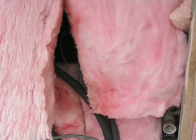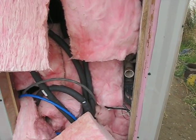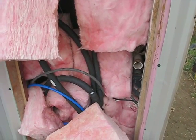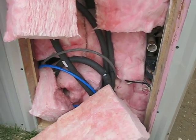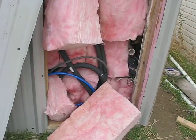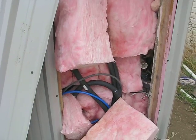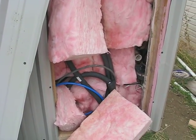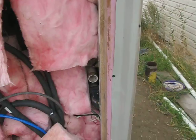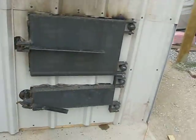Got all my plumbing hooked up. Sorry this looks like a mess — I had to pull that insulation out to turn the valve on. Got my water hooked up all inside for my in-floor heating. I've been running this for about a half an hour. Obviously it takes a while for the heat to build up, but in that half hour my water temperature for about 300 gallons has gone from 49 to 65 degrees.